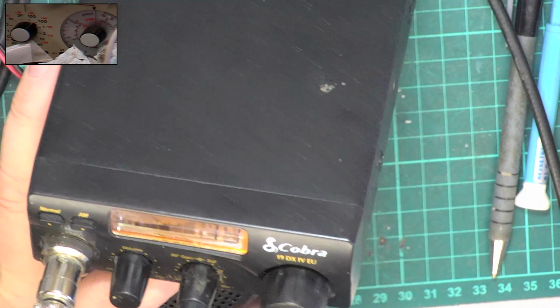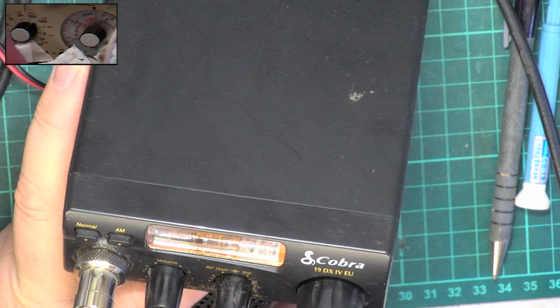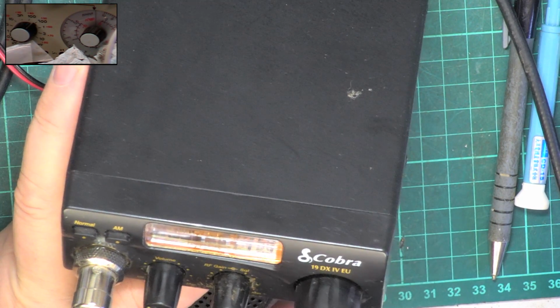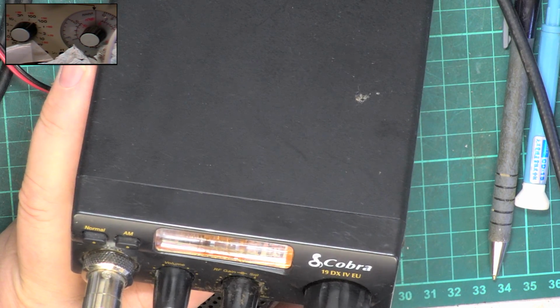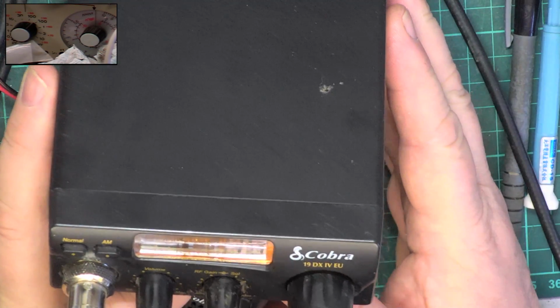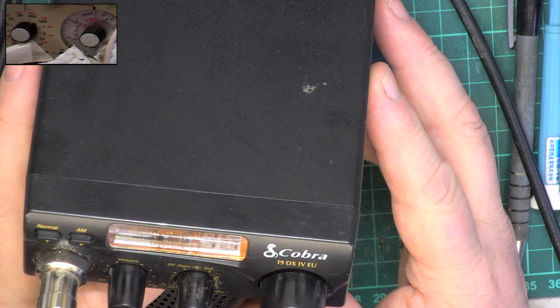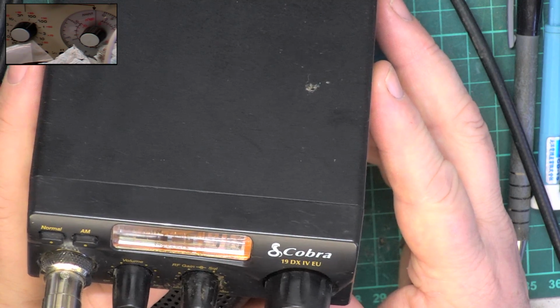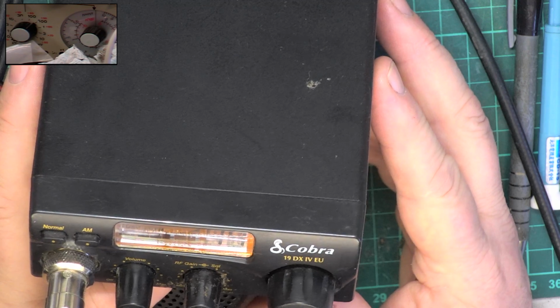When I quote watts here, and I say this is 3.2 or 3.5, whatever we got out of it, remember, this is a commercial two-way radio test set. I've done this power meter comparison. If you want to search for comparison on power meters, we compared it to a well-respected CB meter, and 3 of our watts was probably 4 CB reasonable watts.